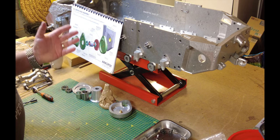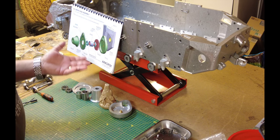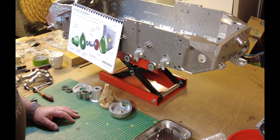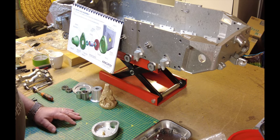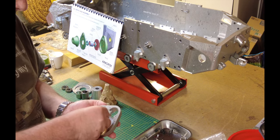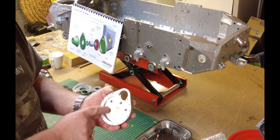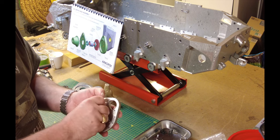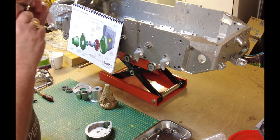This is really all about the sequence of how you do this. The instructions are quite clear, but I'd spend a bit of time studying them to make sure I wasn't going to make any mistakes. So first thing you do is clean everything up as usual. Then inside the main drive case there's a little brass pin — or plug — that goes on there, and they just ask you to superglue that in. So that's what I'm going to do.